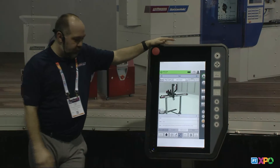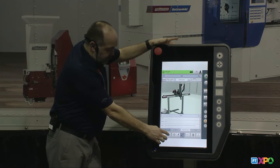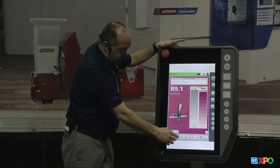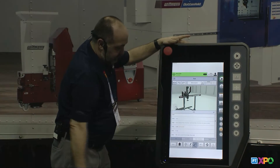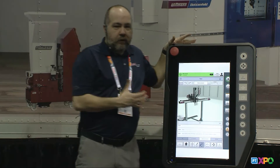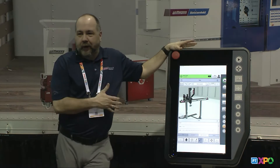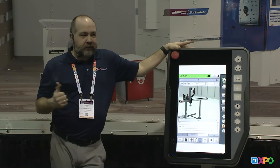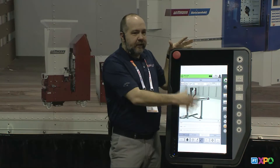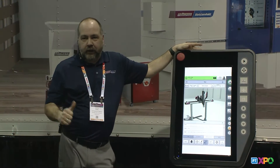The dry cycle won't stop at each position now since we already made adjustments earlier. It's running at slow speed, but if I want to see it run faster I can go to my home screen and raise the speed back up. And if I go into my 3D screen, you'll be able to see it there. So physically right now I just programmed this robot in about 10 minutes — I talked more than I needed to, I could do it in about five minutes. With very little training, in about one day of training you can have a robot set up for quick pick and place.